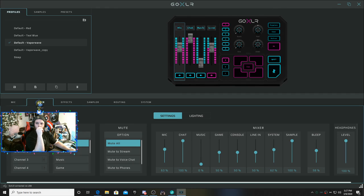Now, buzzing is generally what's called a ground loop. There is potential difference between two different items in the signal path, and it's creating a buzz. You can buy on the internet for about $10 a ground loop isolator, or people call it a GLI. It's essentially a little transformer in here that gets rid of the buzz. You want to put this thing at what we call the termination end, or at the end of the signal.